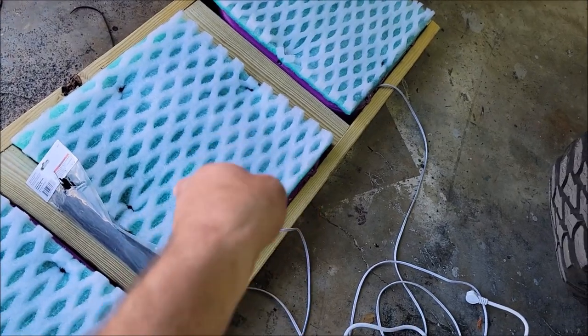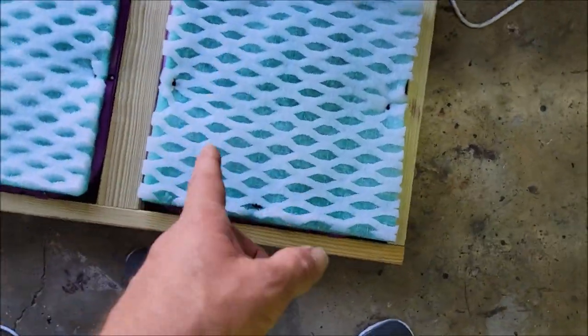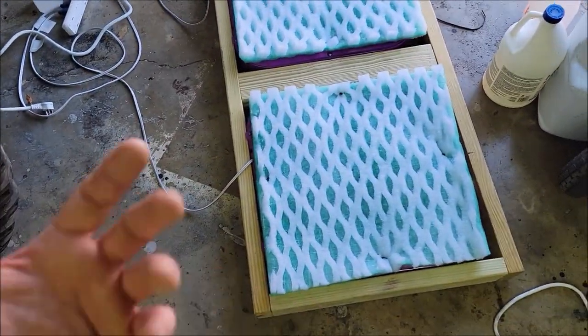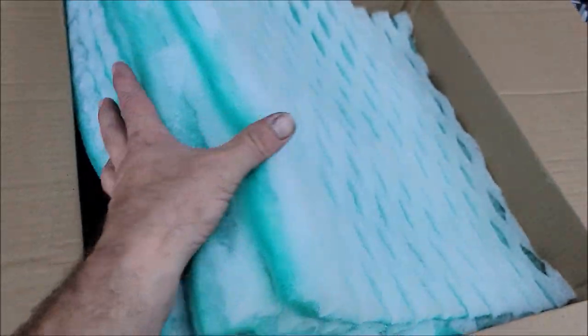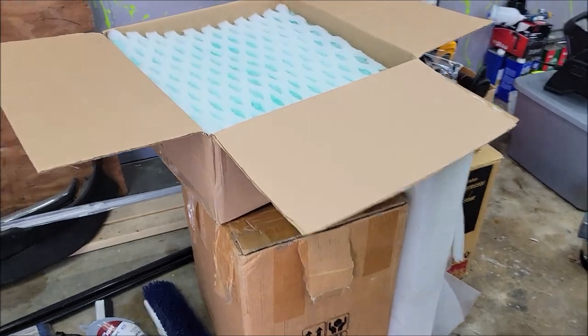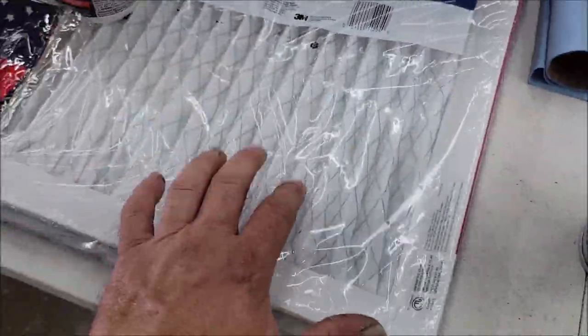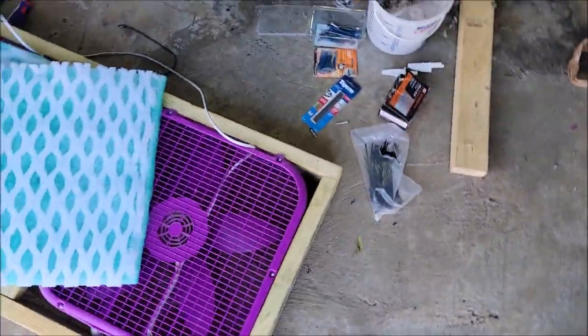Remember, your fans are blowing that way, so it's going to suck this into the back. I probably only needed two wire ties. The cool part about these particular filters is that they're designed so you don't have to replace them a lot — they will take on a lot of overspray but you don't have to replace them regularly. I ordered this 10-pack on Amazon — six left, so six plus four is 10. That 10-pack on Amazon was $55. I'd recommend these over regular home AC filters — I just wanted real booth filters. I can link the web address so you can get those.